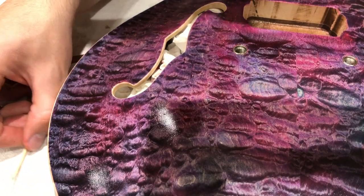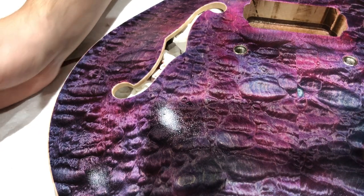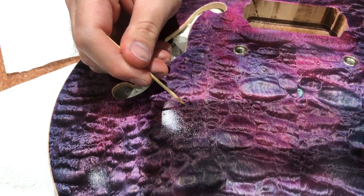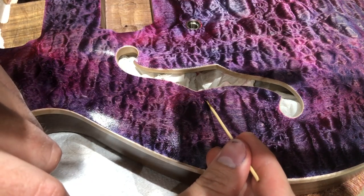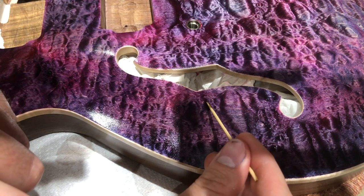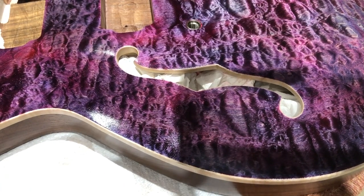After six coats I decided to do a couple of little experiments. I found a couple of what looked like pinholes on the top and filled those with tiny drops of brown Starbond super glue — I used brown thinking that, being made up of the three primary colours, it would blend in well on any kind of dark surface. I also tried tinting a little bit of neat lacquer to fill in those little areas that wouldn't take any stain, and the tinted lacquer did work really well. However, I don't know what possessed me to tint the lacquer with purple, because I didn't use purple on the guitar anywhere. That would have worked much better if I'd used a light brown or a pink, so I might come back and fix that one day.